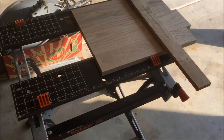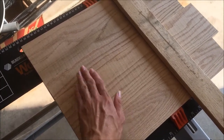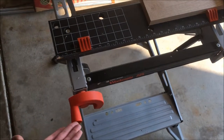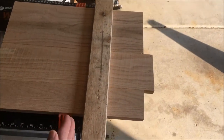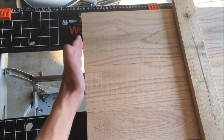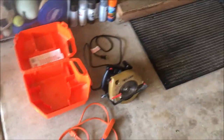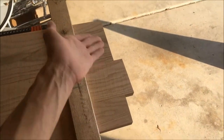It is currently a little later in the day because I had to glue three of these boards together. You can see the joints right there. I have scraped the excess glue off. I found out this table kind of annoys me because it's lefty tighty, righty loosey to open and close it, which is really odd. Now I have to cross-cut it because you can see that's obviously very uneven and it starts to bow out right about here. I don't have a table saw available to me, so I'm just going to use a regular circular saw. In order to do that, I have to build this straight edge which will make the cut go straight.